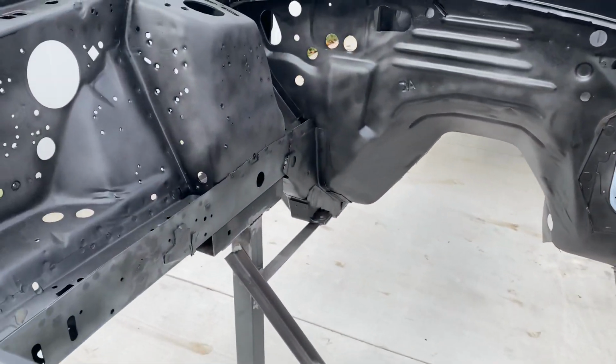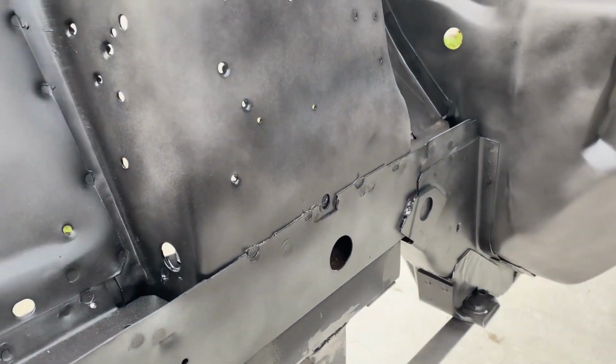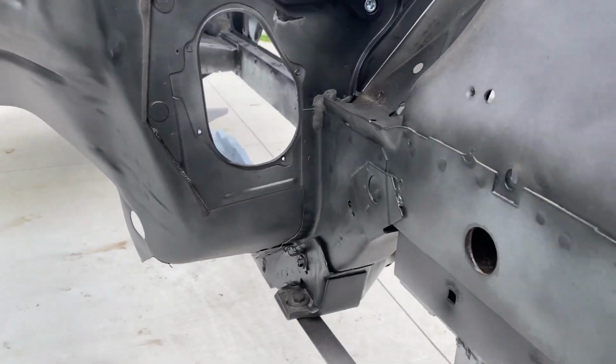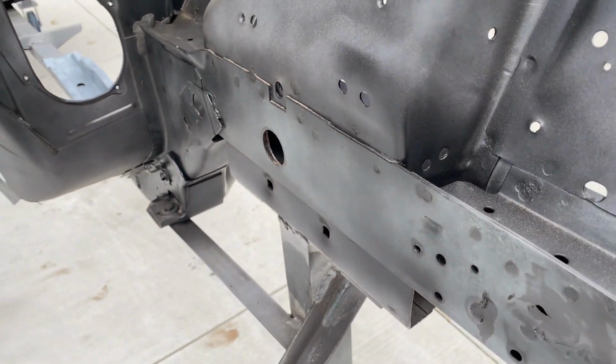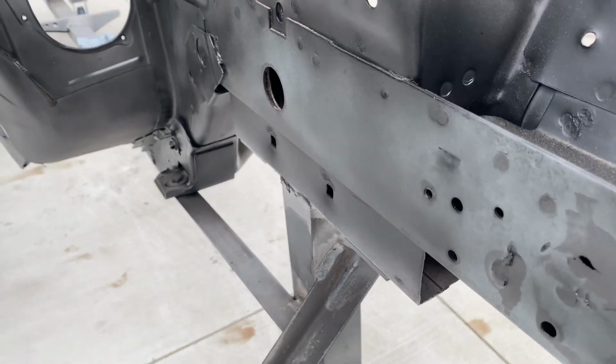For a Michigan car, this car really was rust free. As you can see, the shock towers are great on this car. They look really good. It was just the floor pan that rotted out. It was a factory sunroof car, and I think it just leaked, and over time with the carpet and the underlayment being wet, it just rotted out the floors.